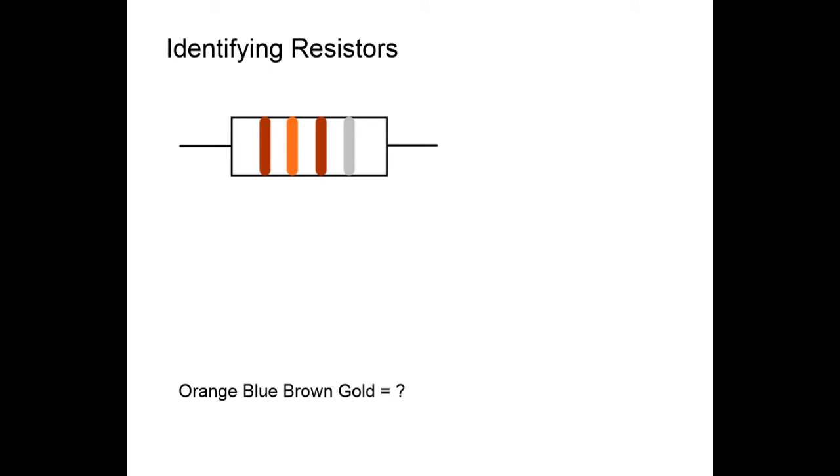In this video we're going to look at identifying resistors by their color code, which is a very important skill. We use the colored bands: the first band is brown, worth one; the second is orange, worth three; and the third band is brown again, worth one — but we don't write the one. That third band means one zero, one lot of zeros, so this is actually 130 ohms.